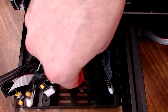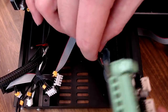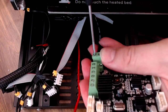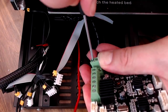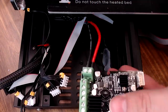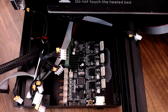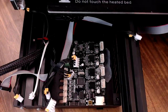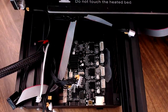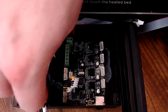We can move all these wires out of the way and slide our new board in. The hardest ones to put on when the board is installed is the input voltage, so I go ahead and do that while the board is out. The outside terminal is the negative one - hold on to the actual green terminal part and get it nice and snug. The other side is the positive one. With that connected, we can slide it in. It sets just like that, and we can put our four screws back in.